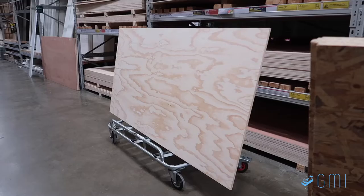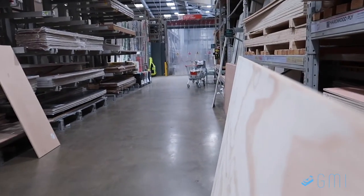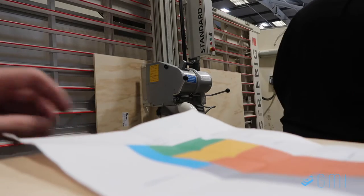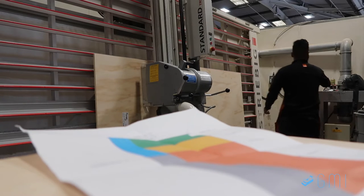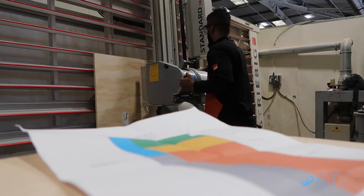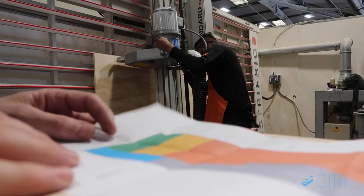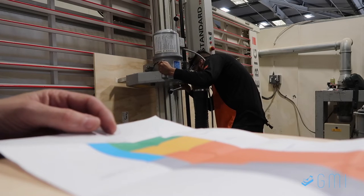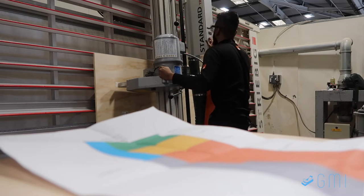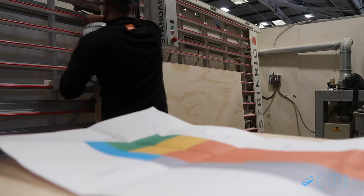Please use it and share it as widely as you want. In the majority of YouTube videos I see, the maker chooses to break down the full-size boards themselves using either a table saw, a circular saw, or something similar. I understand that sometimes you can only cut a piece of wood once you are building the actual project and need to sneak up on that final measurement, but for projects like this one and cupboard carcasses, I try to have my boards pre-cut to size as often as I can. By spending just a bit more time on design and thinking through a well-prepared cutting list, you can very often have your pieces cut to a very accurate dimension, which will cut down your own work time, especially if you don't have loads of space to maneuver and process a full board.